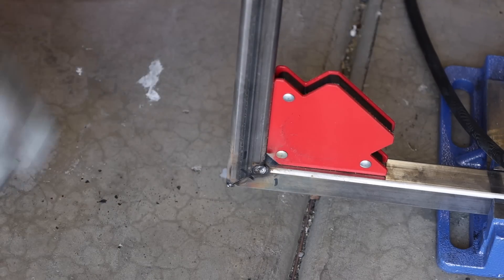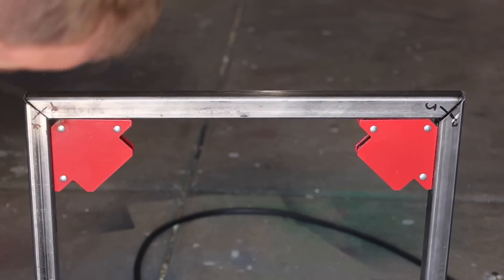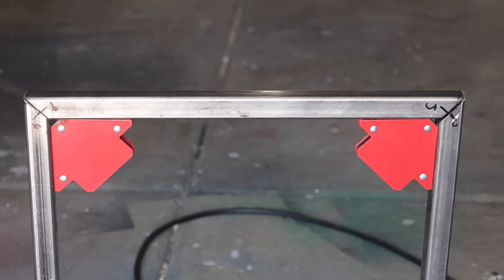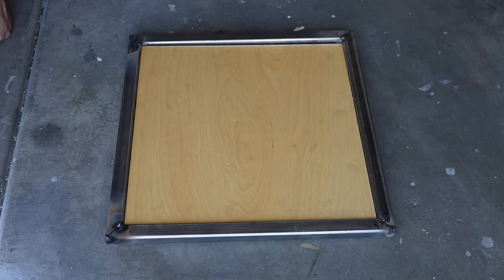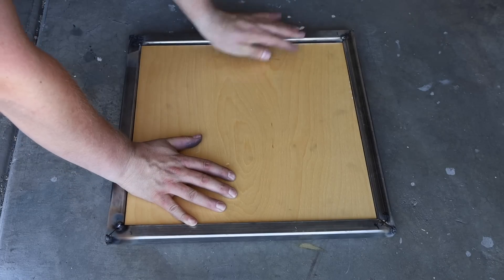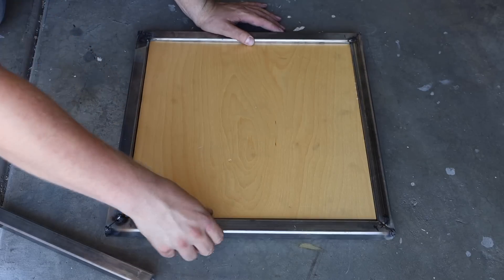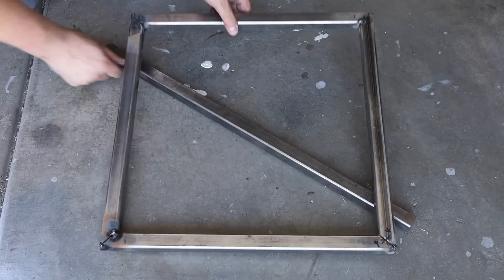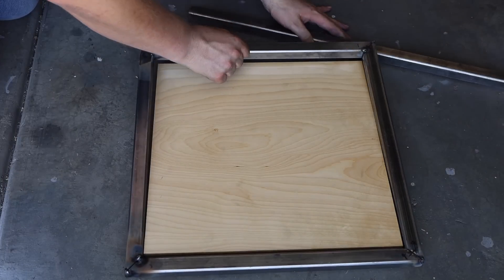Once I have a couple of tacks on each face, I'll put the upper bar in using those same magnetic clamps on both sides, line everything up, and get a couple of tack welds in. Before adding more tacks or welding it out, I'm going to make sure the board fits in just right — this is also a good check to see if it's sitting flat. It's a little out of flat, so I'll use that extra piece of material and, since I've only tacked one face, I can move it around and bend it flat.